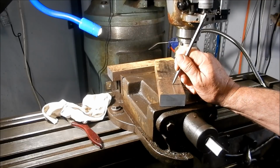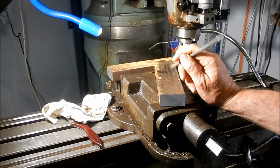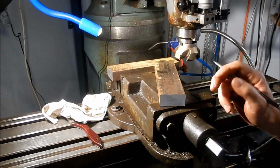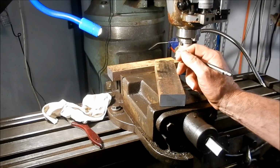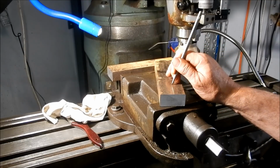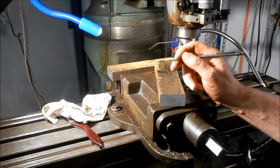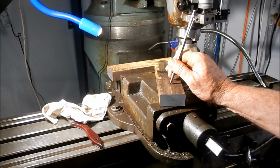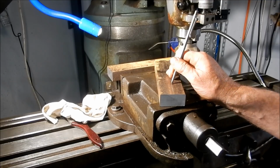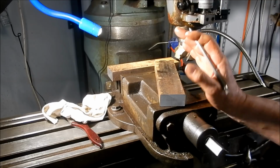Long slender shafts are an absolute classic. Cold roll stock, which has had that final cold roll operation done on it, whether it's a drawing operation or a rolling operation to give that nice bright finish, tends to put stresses more so into material than what black stock is. So if you've got long slender shafts, you will start to see them move. The chrome moly steels, your high tensile steels, your 4140s and 25s and 26s are probably the worst. They'll come in a peel bar stock form, and they tend to move more than anything.